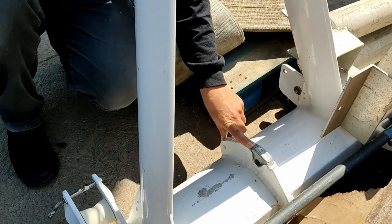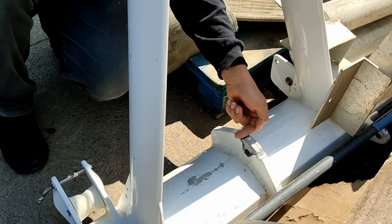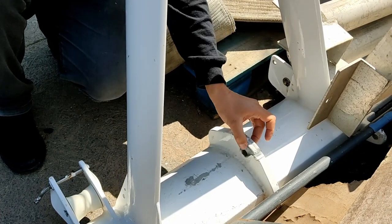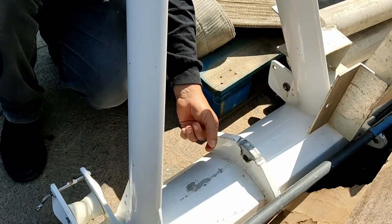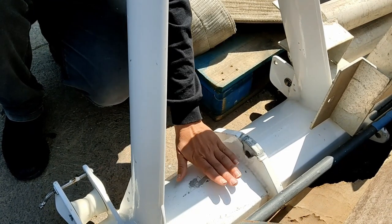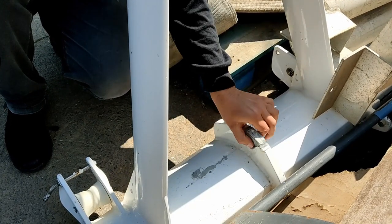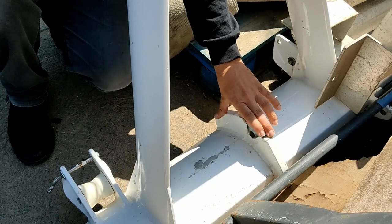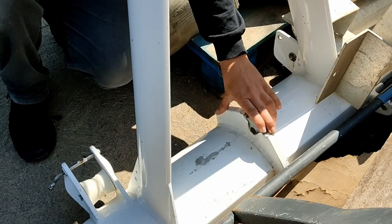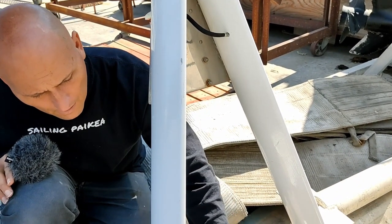Here's the old forestay attachment point on the beam. The forestay is attached not at the back, not at the front, and not even in the middle — it's in what looks like a funny position, but it's not. If you project the line of the forestay down through the beam to what we call the neutral plane — the middle this way and the middle that way — the line of the forestay actually connects at that middle point inside the beam. This means it doesn't produce any torque or torsion through the beam from rig load, which is very important with these pinned arrangement beams.